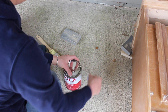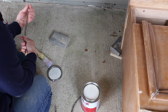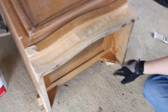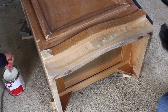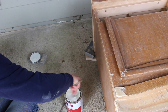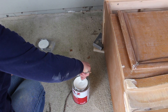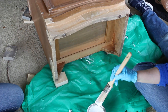Because of the odor associated with this piece, we're going to have to paint every single surface — not just the exterior as you probably would normally on a piece. Even this underside has to be painted, otherwise the odor from the smoke and the water damage will continue to permeate the house, and that's not acceptable. So look at that stirring action — we're now ready to paint, and we're using standard Kilz.